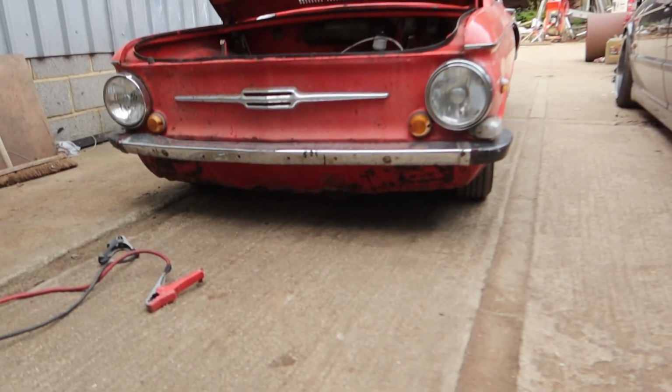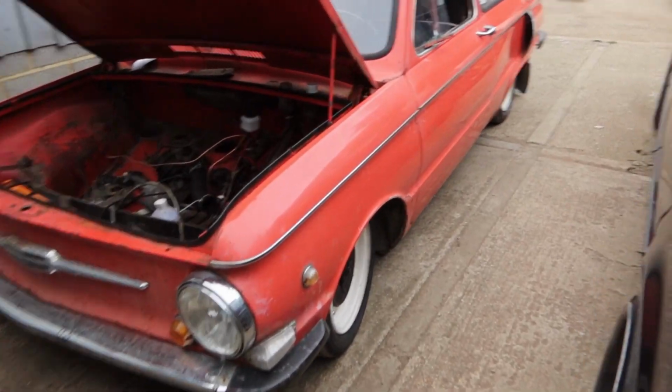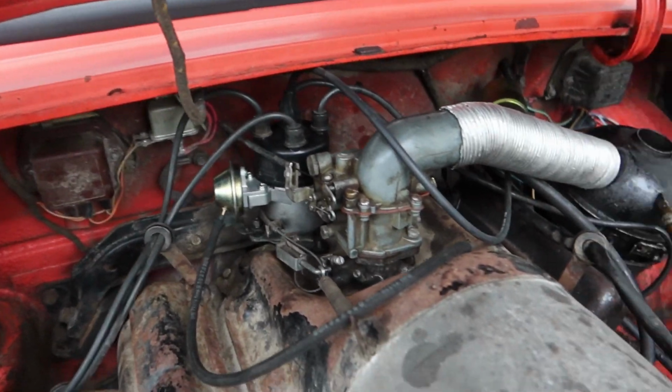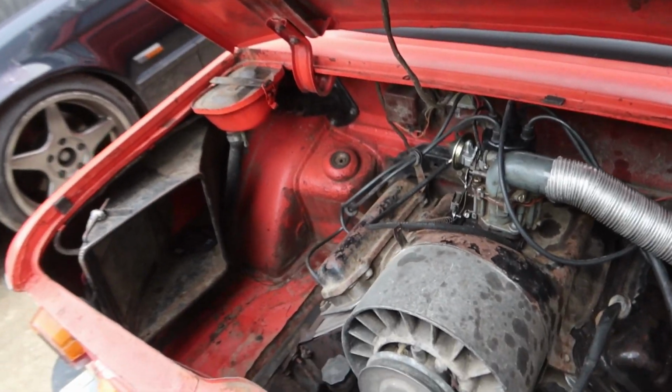Yo, it's been about 2 days since I picked up this camera. It's been busy, I've been excited. Update on the car, it's now ready for Retro Rides Weekender. Spent a bit of work on it, lowered it a bit more, raised it, been sorting the suspension out. Went to fit the new carb and it was the wrong one. Went to change the gaskets. All the brand new gaskets on this carb were shot and someone siliconed them together, so didn't do that.